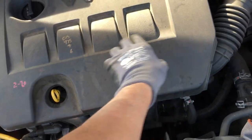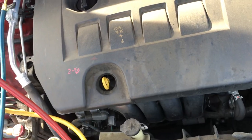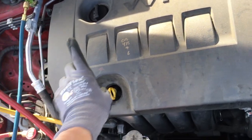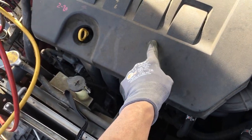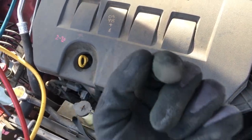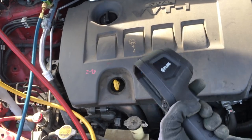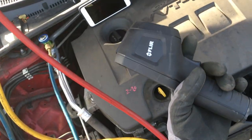Say I want to know the temperature of a shiny, polished aluminum valve cover or intake manifold. I'm using my infrared camera, and there's a really hot item a foot away — like an exhaust manifold — with direct line-of-sight contact. When I try to take the temperature of the shiny surface, the infrared radiation energy from that nearby hot item will reflect off the shiny surface and come back up into the camera, giving me a reading that's a mixture of both surfaces. These tools are good for comparing two like items at the same time, but you have to know the limitations of your tool.